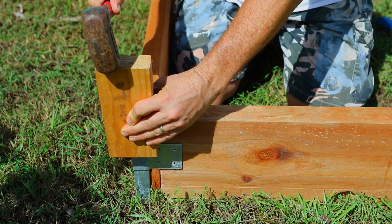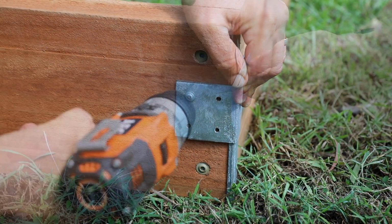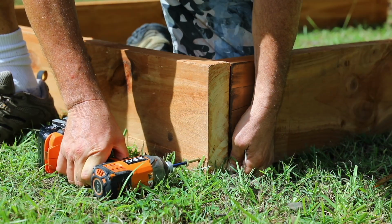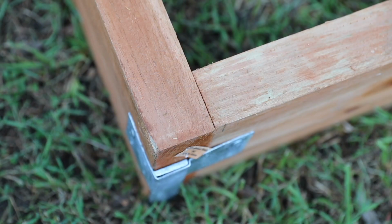You want your bracket to sit about halfway down the face. Put a button screw through each side. You do want to have some movement at this stage, so don't add all the screws. Add the other long side and screw together to make sure you position it correctly. The corner braces have one longer edge and this needs to span the join between the panels. So in our case, each board butts up to the inside of the last to allow that spanning.